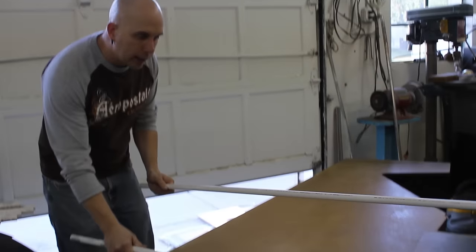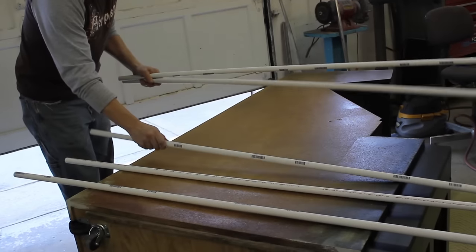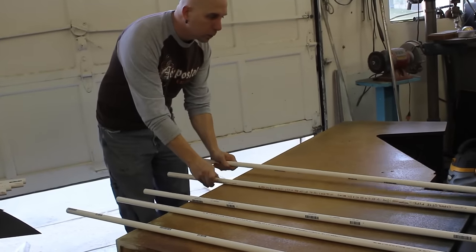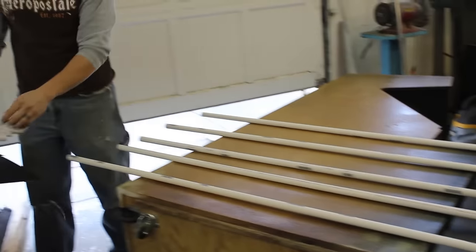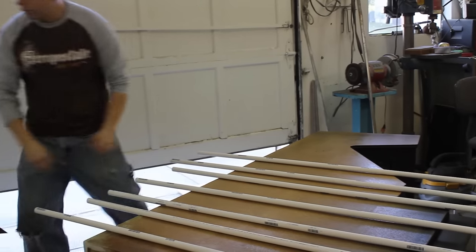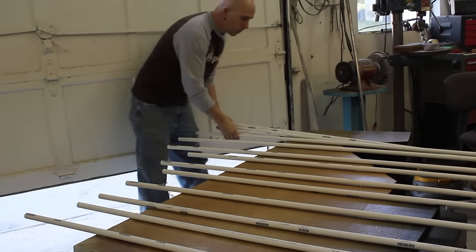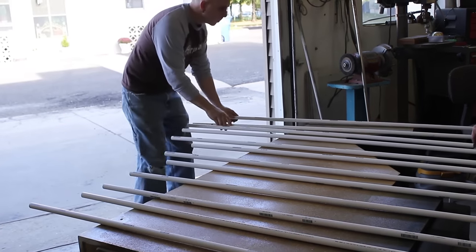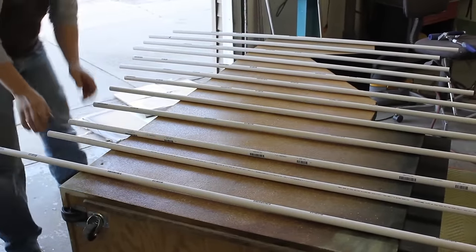So now we have these plastics that I talked about. I'm going to space them out about 6-8 inches apart. And you don't have to worry about these sticking like you would think, oh my God, are they gonna glue down? They're not going to. And you want them long enough, you see here it's long enough so I can reach and pull them out from underneath of the laminate. Want them roughly even. It doesn't have to be rocket science here.